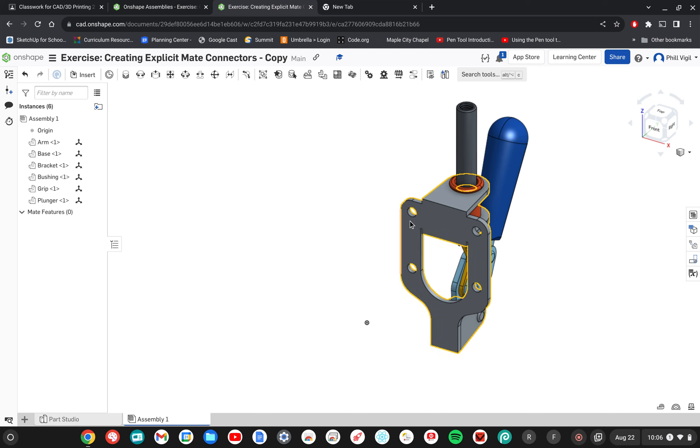The first thing we want to do is ground one of our parts. For this exercise it makes sense to use the base as our grounded element — the one thing that doesn't move — and all the other parts are going to connect to it. Click on the base and you get a centroid, which allows you to place a reference point on the object. Find the center of the centroid, click, hold, and drag it to the center of the object, then release to accept the snap point.